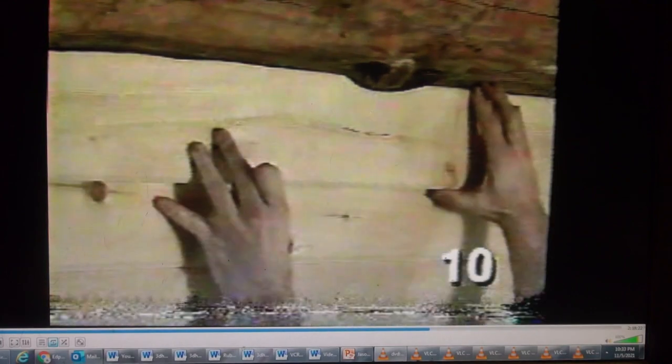Here's an interesting treatment: we took a leftover log, custom cut it, and slipped it over the end of the partition wall — kind of like a log trim. We're also covering up the slip joints built into the partition walls to accommodate log settling. We're securing the trim above the gap and not below, so the trim can slide down as the logs settle.